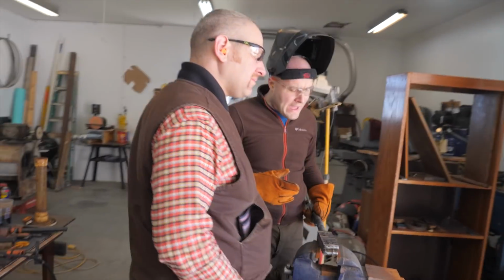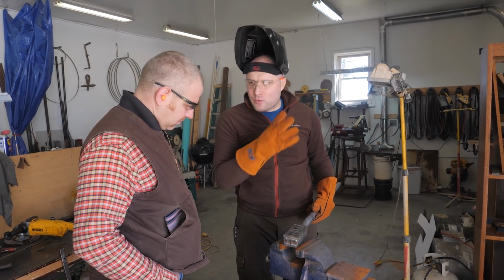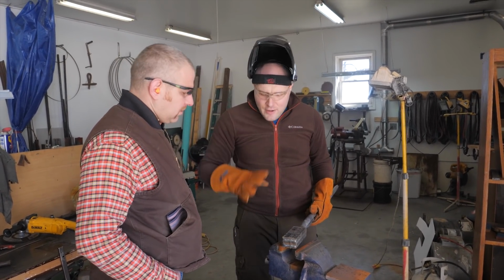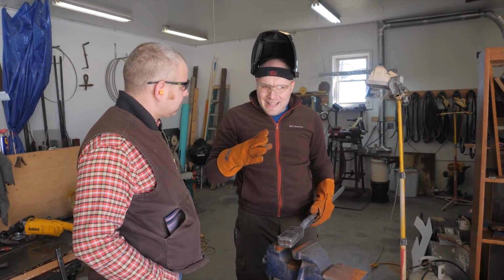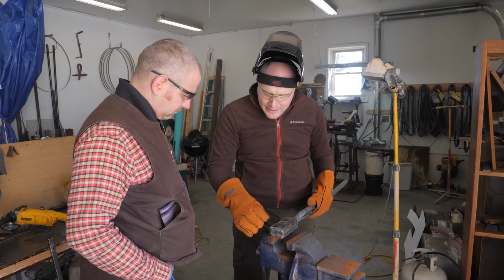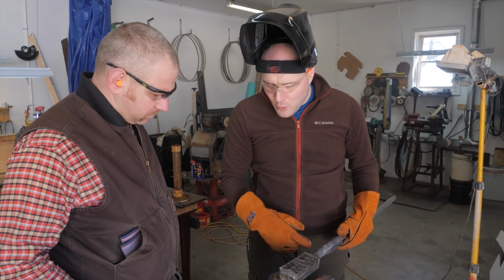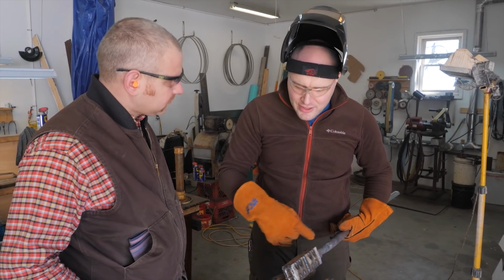When I'm forging on my own, because hot metal is larger than cold metal, it wants to expand right away when the forge is super hot. So if you let it heat up slowly, the billet will more likely expand at the same rate. If this expands too quickly, it'll open up a big gap and let air and scale and nasty stuff form in there, and then you can get blisters on the sides of your billet.